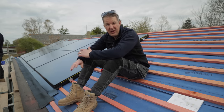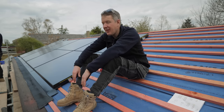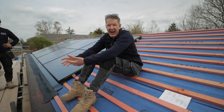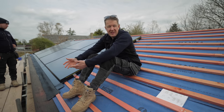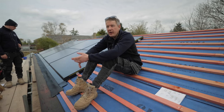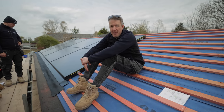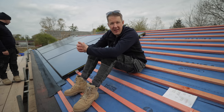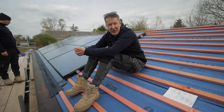It's probably cheaper to put in roof solar than to put on roof solar on top of a load of lovely new tiles, so that's definitely something to factor into cost. Can you install an in roof system on an old roof? Well you can, but there might be issues - when the roof tiles come off you might find that the batons are old and rotten.